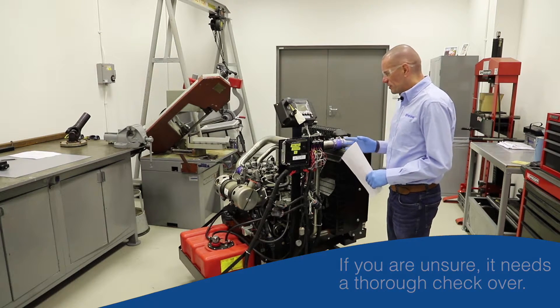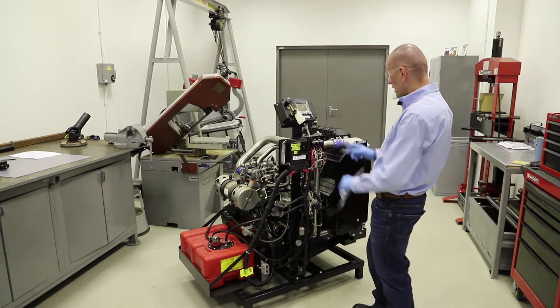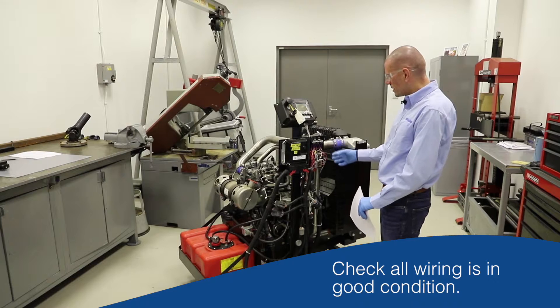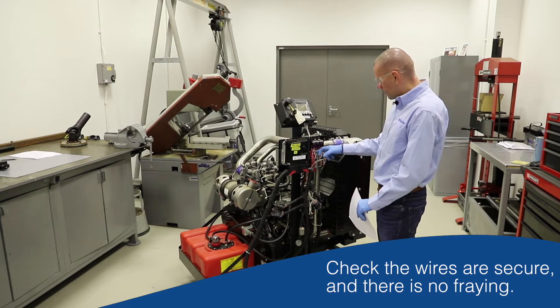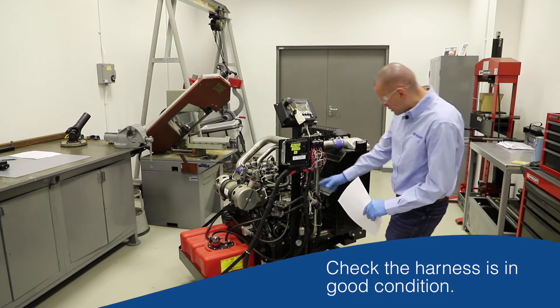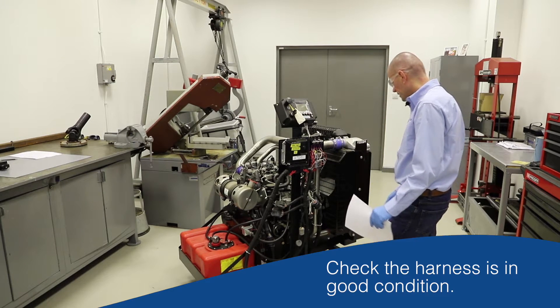The sort of things we're looking for are anything amiss. Starting here with the control panel and the electrical panel: does this wiring look like it's in good condition? Is there any frayed wire? Is the wire secure as it normally is? Is anything obviously loose? It all looks okay. The harness looks in good condition — it looks like it did yesterday — all in operating order.